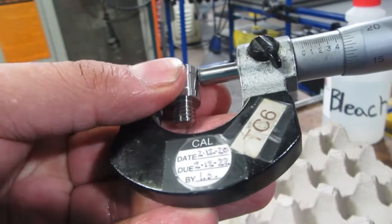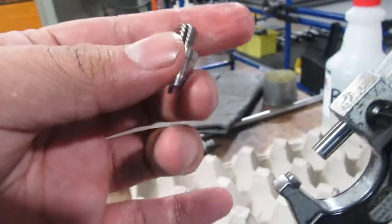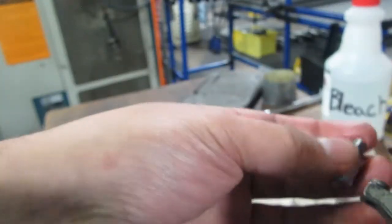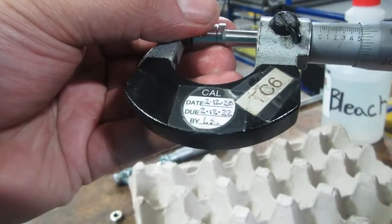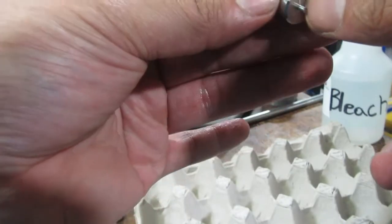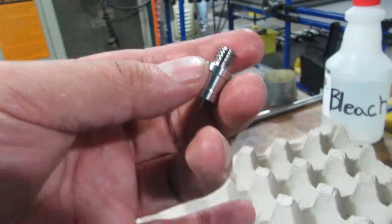Just within the tolerance - heck yeah! I guess the only other thing I need to check is the shoulder right here. It's hard to do this while I'm trying to film. It's 25 over, which will clean up on this back end after we cut off this nipple on the second op, which should be like a 15 to 30 second cycle, if not less.